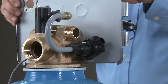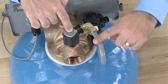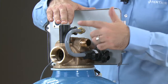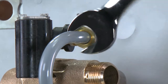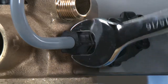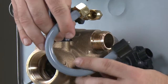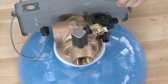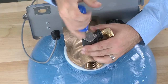With that removed, we can move to the brine assembly on the rear. This particular assembly has the injector in the top, followed down by a J-tube to our brine valve. To remove, we begin by loosening the two nuts that hold the J-tube between the injector housing and the brine valve. Loosen the brass nuts with a 13/16ths wrench and the plastic nuts with a 15/16ths wrench. Once the nuts are loose, you can pull the J-tube to the rear of the unit. This will give us access to the injector assembly at the top. Using a quarter-inch driver or a slotted screwdriver, we can loosen the two screws.